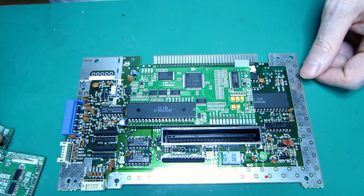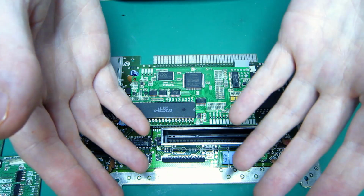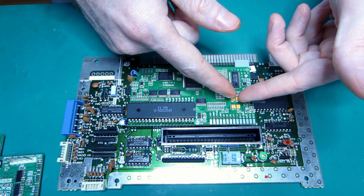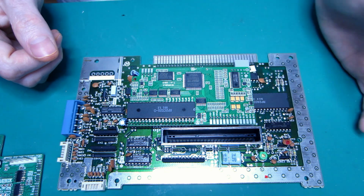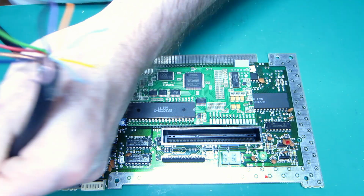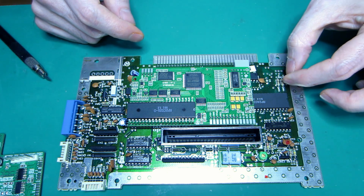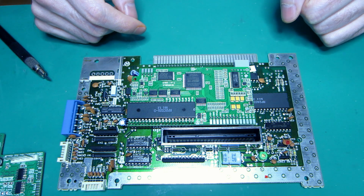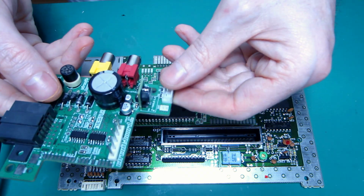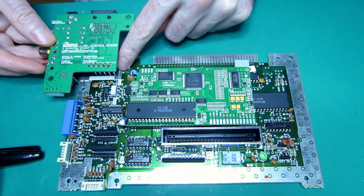Another thing is, since I'm going to use this multi AV port, we're going to use the same SCART cable as the Super NES. I already have those capacitors inside the SCART cable, so I'm going to remove that, and then use a thick cable like this one to wire everything from here. Also the audio from those two resistors to there, and I will try to film every single part because I have all the LEDs here to wire, all the ground here to the ground plate.